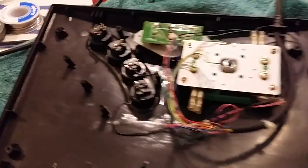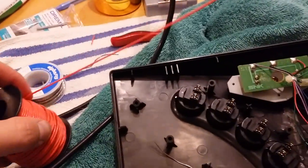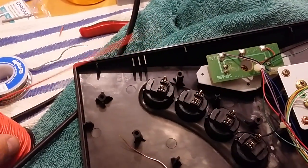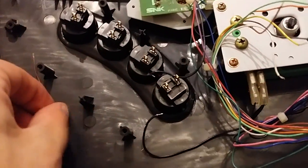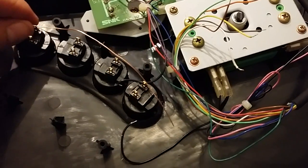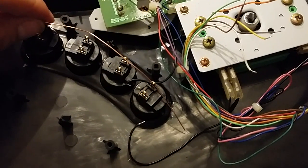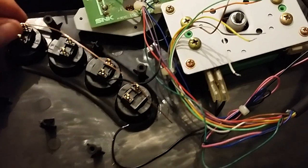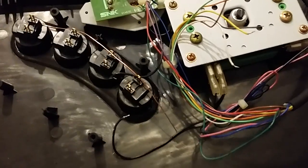Just quickly I'm going to show you what I did off camera. I have this 22 gauge solid core wire and I cut it in inch increments and just stripped it all the way, so I've got this bare piece of wire. What I'm going to do is solder it to the end and just kind of weave it through the prongs — and on the last one we're going to solder this along with the three ground wires to the last button, so they'll all be in line in the circuit.